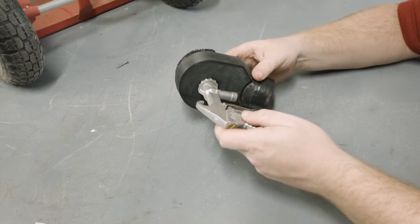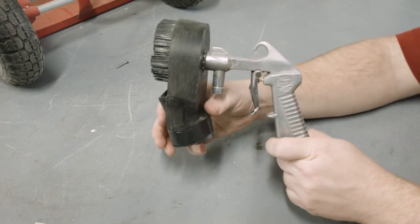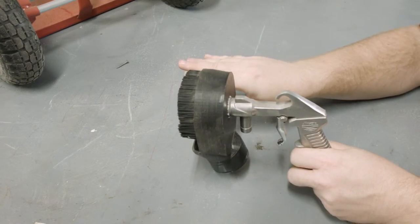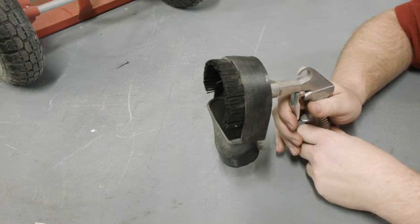Basically you just slide it in. Your air hose attaches to the gun down here, your blasting media attaches here, and then the vacuum attaches here. And as you move back and forth, media comes out, hits it, starts to fall, and then gets picked up by the collector and taken back to the cyclone separator.